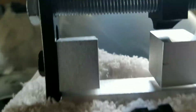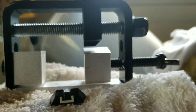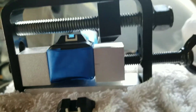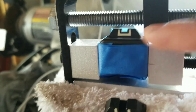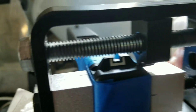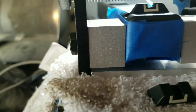This tool has a slanted side and a flat side. I actually prefer the flat side — it helps me line everything up a little bit better. I'm going to zip this in there carefully and clamp it down. You want it to pretty much hit the center of the dovetail and be close to the base, but not touching your slide. If it's touching your slide, it's going to cause more resistance and you're going to scratch your slide. Make sure you're pretty centered in that dovetail and relatively low, then you're ready to push it out.